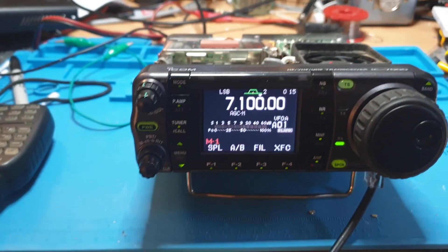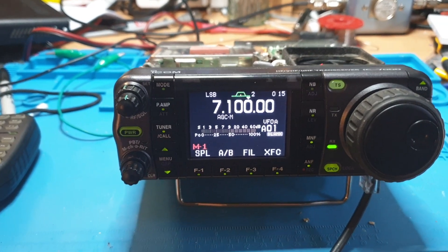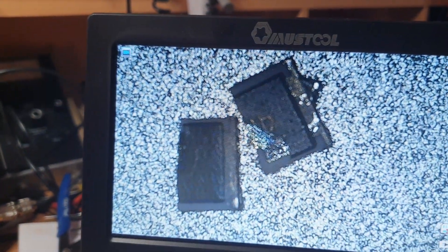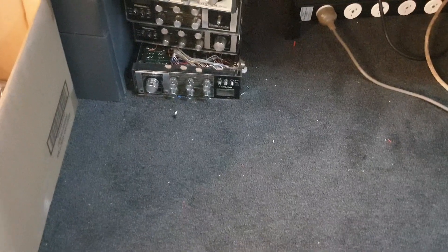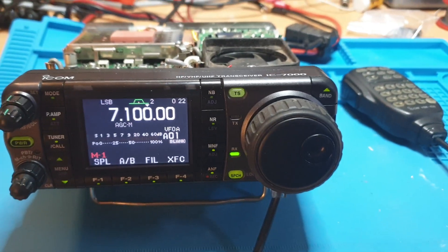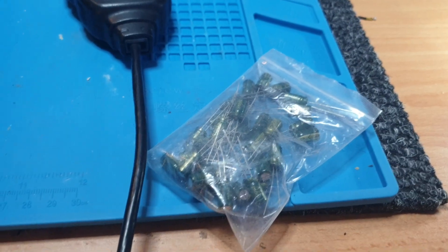Just a couple of tips — well, probably things not to do. I ended up fitting a little electrolytic in there. There was a shorted electrolytic which is probably sitting on my bench somewhere. All I can find is that 4.7 ohm resistor that was cracked in half. The capacitor is so small I can't find it — unfortunately gone. I'd love to show you what it measured.